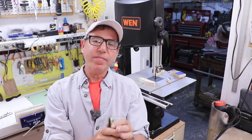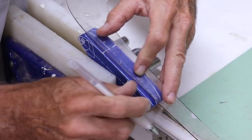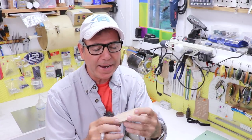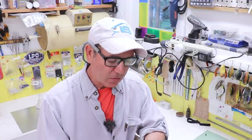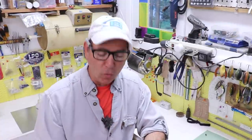There's one other detail I want to show: the shape of the body from top to bottom. How it tapers from the top of the head down to the chin and belly area, creating almost a triangle shape — and that's what I'm going to do with this one too. On the taper of the body front to back, I'm doing a nice gentle taper with some true curves. I'm using a draftsman's curve to help me so I don't have to scribble. The wide point is one third of the way back, which is the widest part — about five eighths of an inch. The only thing left is to start shaping this on the belt sander.